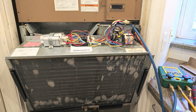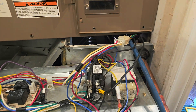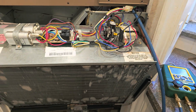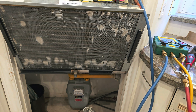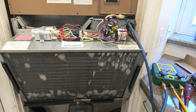I have it hooked up in here. I just turned on the unit and my compressor kicked in. Right now I'm adding a small spray charge to the system. The unit seems to be responding fine - the compressor is okay and the unit is working really fine. I'm going to hook it up and you'll see my condenser pressure coming up nicely now.